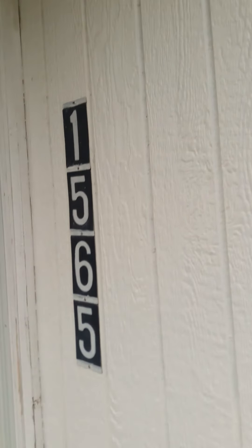I notice there's distress on this house — on the corner here, there's distress on the windowpane wood. That corner looks like it's a little waterlogged; there has been some overflow in the past. I'm concerned that if we pressure wash, the paint's going to fly right off in certain areas because it's lifted. The gutters need to be washed.